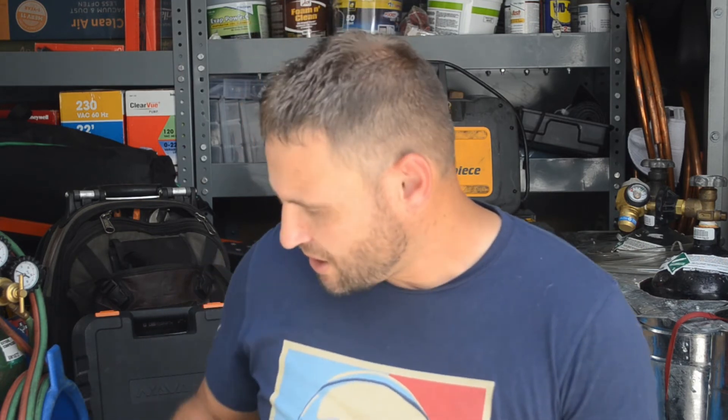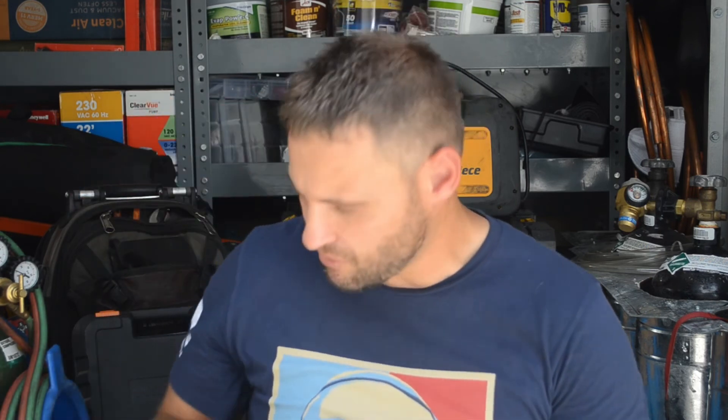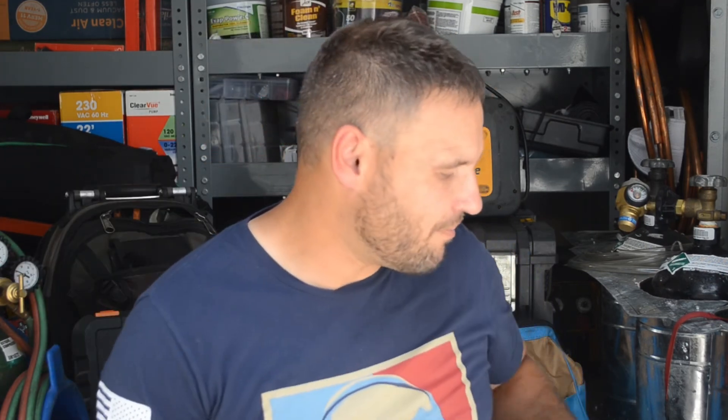That's my takeaway for the new apprentice: if you're just getting into this, if you're considering making your first purchases or wanting to know what you should do getting into the trade, go this route first — go analog, learn what's going on. You're always going to need a good backup. This doesn't need batteries, it's going to keep working in the rain. If you buy a good analog gauge, you'll never have to replace it and you'll always have it when your fancy stuff goes out. My Testo kit runs on triple-A batteries and it eats them — I'm always replacing one because a little red light is blinking on one of my temperature clamps or pressure probes. That's why I still have the FieldPiece as a backup.